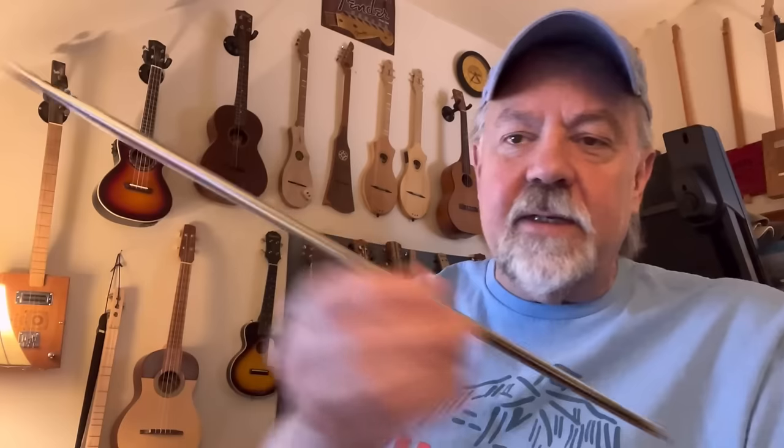Every antenna is different. Here's just a little aerial antenna — this feed point would be different depending on the height, the ground it sat on, every location. There are so many things going on that you really don't want to go out and measure the feed point. The answer is: we're not trying to match a transformer to the wire. We're trying to match the wire to the transformer, to a balun or an unun. I'll give you a quick, brief, and simple way of doing it with wire lengths that are typical and have historically worked.